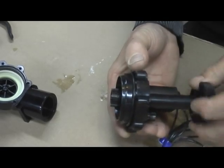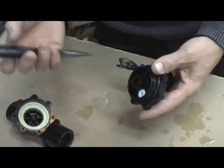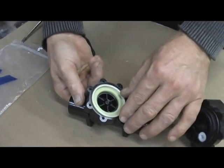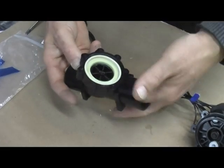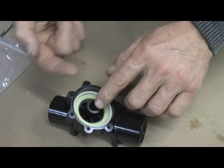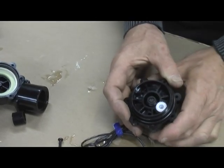So when you remove this gear, you've removed your flow control. You have to wind it out to the end — and it's out. Don't worry about the knob anymore. If your flow control gear doesn't come out easily and stays stuck in there a little bit, you can use a pair of needle nose pliers — gently pull it out and remove it that way. When you activate the solenoid on top, that allows the diaphragm to pull back and allows the water to go through. It doesn't pull back out of the housing; it stays near the top but allows the flow to go right through, and then the spring pushes it back. Without the gear, nothing inside the solenoid housing holds back the diaphragm — and that's all flow control does. What you have left is the knurled knob, which is sealed against water leak, and you're now missing the flow control part, which was that black gear.